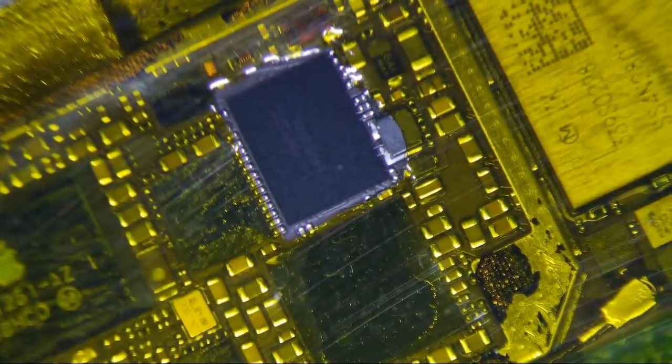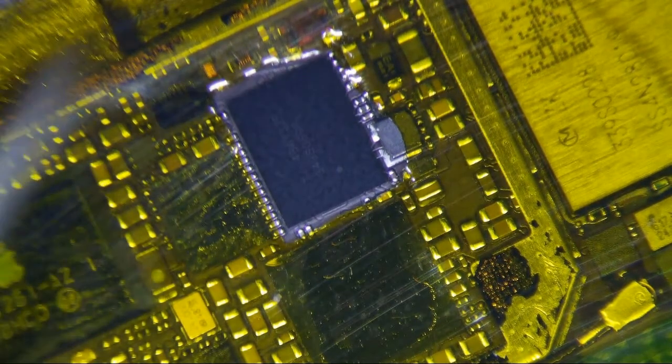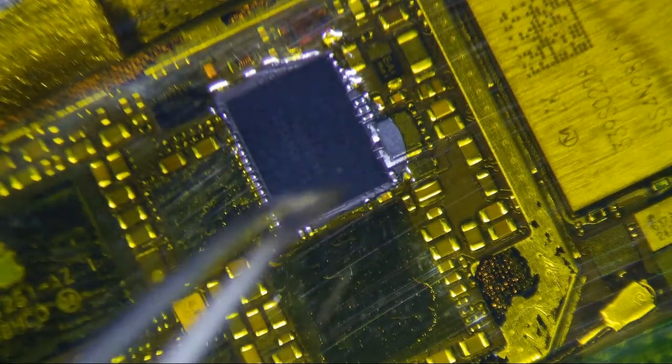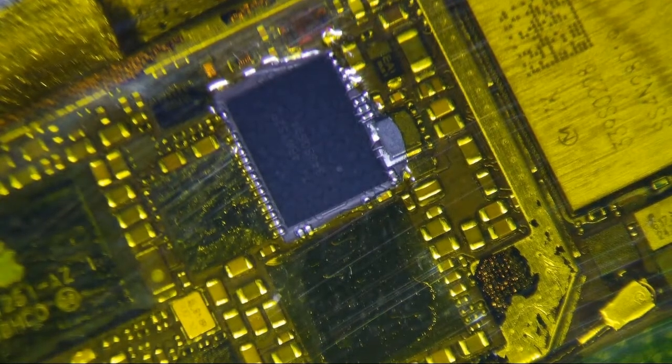I have a classic touch IC repair here, gray bars and everything. I'm just going to do my thing. You've seen this a bunch of times already. What I do is cut a piece of Kapton tape. I use a 1-inch Kapton and just cut a rectangle around it. Just make sure I can get proper airflow all around it, so don't cut it too close.